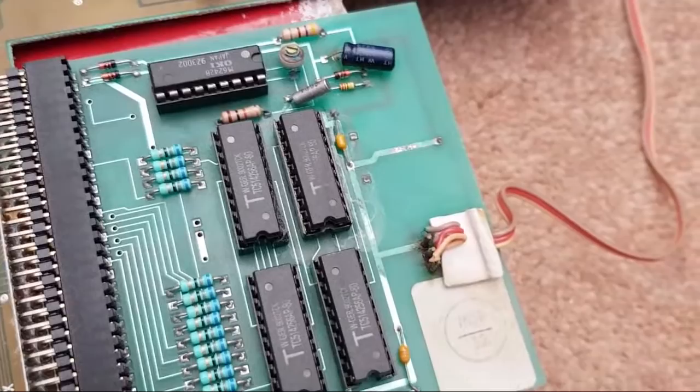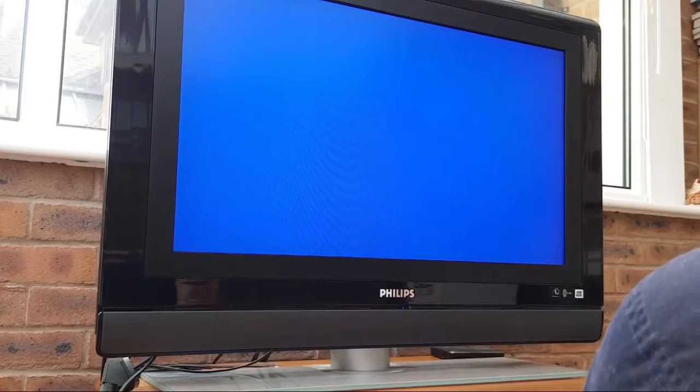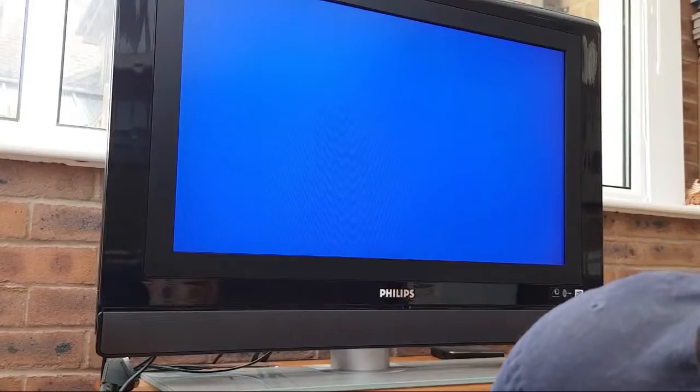No, I didn't. It's in the right way up, and it's a yellow screen. You can see it's the right way up. So, yeah, that chip is faulty. That's an example of the yellow screen giving you random curveballs, isn't it? It could be literally anything when you get a yellow screen. The last thing I want is people associating yellow screen with just the Buster, going, oh, you've got a yellow screen, it's a Buster problem. Well, you don't have a Buster on these boards. Yellow screen means something's gone wrong early in the boot process.